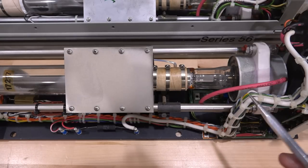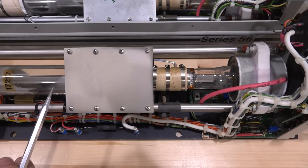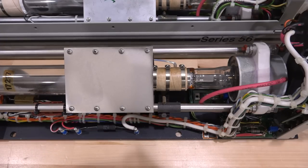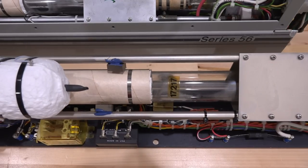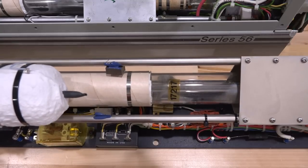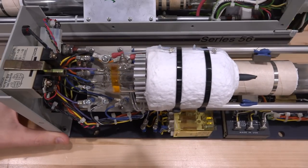There's the capillary, which is the confinement point for the cadmium. There's the cadmium reservoir where the cadmium is going to be heated up and melted. You can see a rod right through here — the end of the rod is the main discharge capillary of the laser. Further down, there's a temperature sensor — there's a diode that measures the temperature of the entire tube, and if it starts overheating it's going to shut down. There needs to be constant airflow as the plasma gets really hot, and these heaters get really hot too.